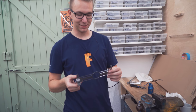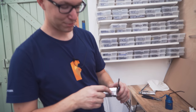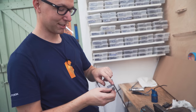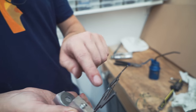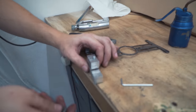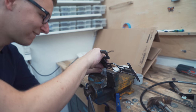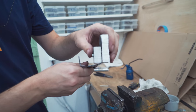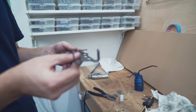Now I am preparing the plates that will hold the vibraphone plates - I have to bend up these four edges. I made a little jig so I always have the right length: two aluminium pieces and a screw through a hole, but I need a washer because the part will tilt a little bit without material under here. Alignment looks good - bend it. The bend doesn't look so nice yet, so I give it a little squeeze in the vise. Now it's nice and straight.